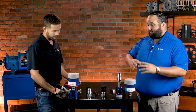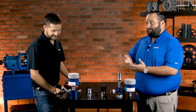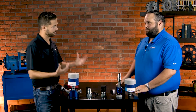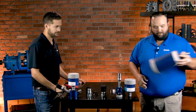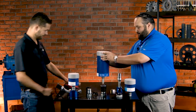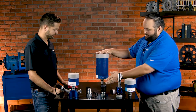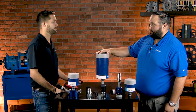TTI offers a ton of different breather options. For a hydraulic system with a lot of oil and air moving in and out, you might need a larger breather to handle all that moisture. The threaded port makes it easy to size up — for example, moving from the standard power breather to the Titan Power Breather, which has a higher desiccant capacity.